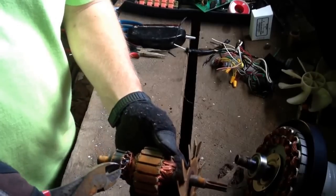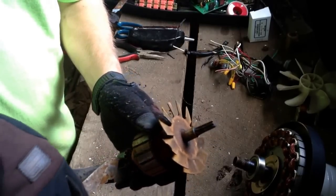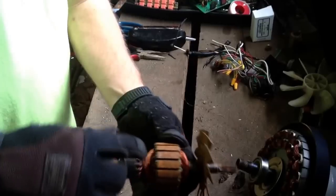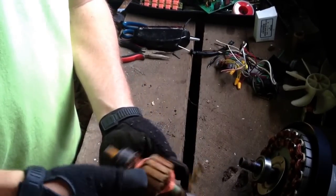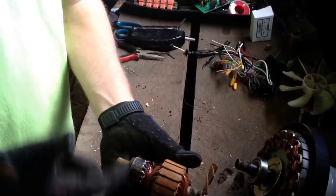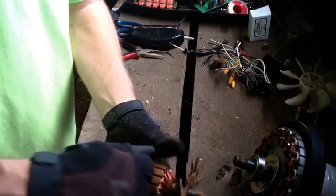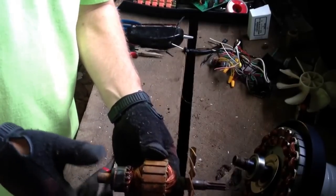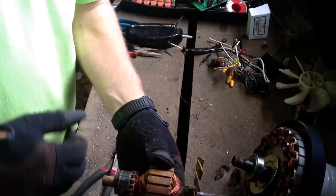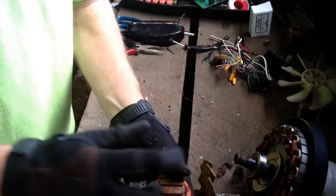Go all around the top and that's going to free up your copper. Once you go all the way around and get them all clipped loose, that's going to free up all this copper. Then, after you get all your pieces in between here out, you just start working your copper through those windings, start pulling it through. Once you get all this loose, you'll be able to take seven or eight strands of copper and pull them through and work all those out. That way you don't have to risk your fingers on a bandsaw or waste copper trying to use a grinder.